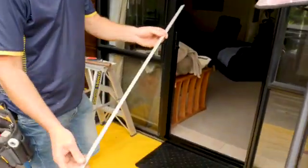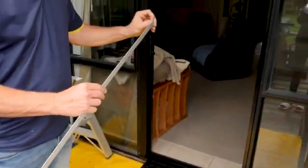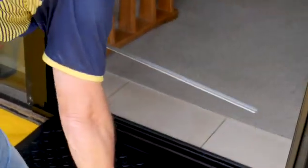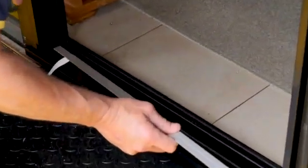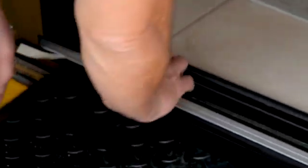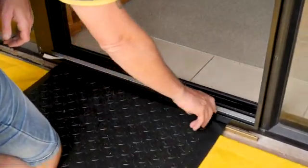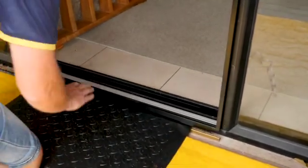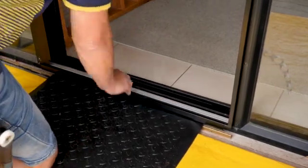So the next thing is your track. As you see, you've got a slotted end for your track. This is going to be the end which goes into the housing section for the cartridge. I peel a little bit of the tape off. And again, you can measure this, but really your eye meter is pretty good. So inside the center of this housing there is a die line. You're wanting to match the middle of the die line that's on this track to line up with that housing. And you normally leave a couple of mils, 2 or 3 mils from the end of that. In this case I'm quite tight with my cartridge, so I've got it right at the back. See how that's nice and parallel? So I just tape it on, make sure it's on, and that's not going anywhere.